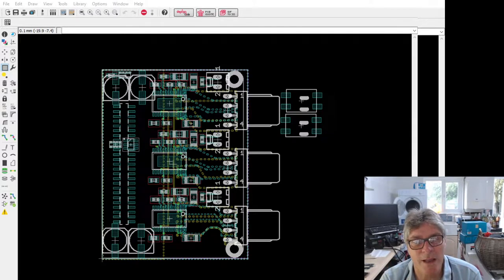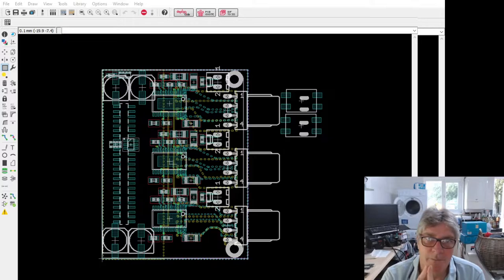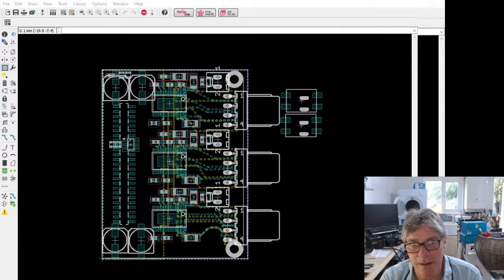One of the other things I was thinking about that'd be nice as an add-on, later on, I'd like to add things like power management and MPPTs and stuff. If you're going to have battery controlled systems, you need something like an MPPT to handle high efficiency power transfer from the panels into the battery. But the easiest way to do it from the start, and also, solar is not that reliable, particularly in the UK, and certainly not reliable at night. The other thing that you can do is you can just power it and have it charge a battery, so it's got a reserve. But I was thinking probably the easiest way of doing that, I mean, we can do it via USB, but if something would be outside, you probably want to do longer cable runs.